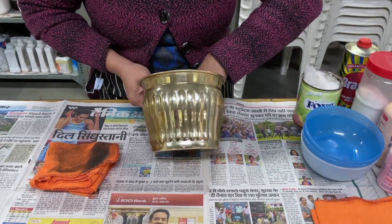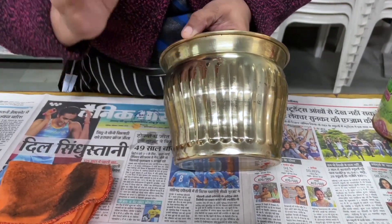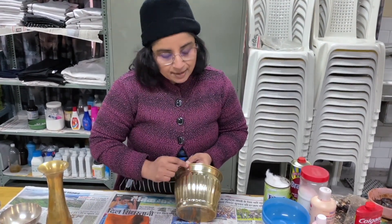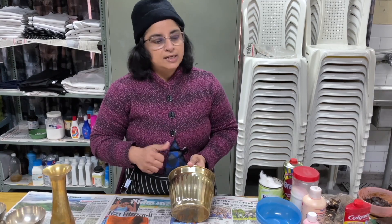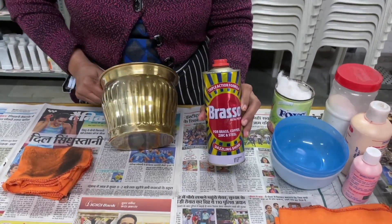This area is now clean but we still need to make it chemically clean. Chemically clean means even though it looks clean, there is still chemical residue on it. This is a decorative article, but if you are using something to hold food or serve food, you must always make it chemically clean — wash it again with soap and detergent and wipe it dry before placing it near any food, because these chemicals are poisonous in nature. Traditional method uses tamarind paste and salt; modern method uses a chemical polish like Brasso.